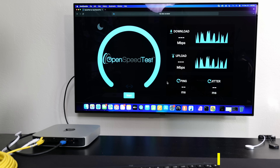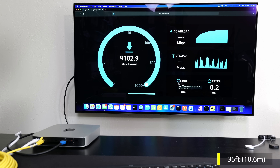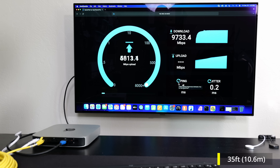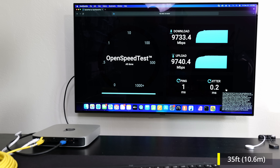I've got the 35-foot cable connected, which is a little over 10 meters. It's still getting just about full 10 Gbps speeds. That's kind of impressive to me because for years I've read that Cat 5e is capped to gigabit speeds — it always points it out as gigabit — but we're getting full 10 Gbps even on a 35-foot cable.